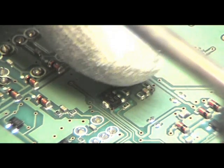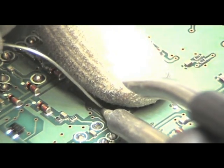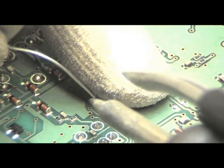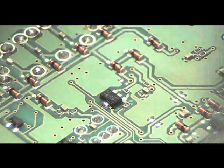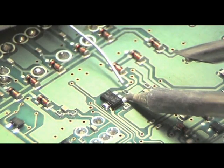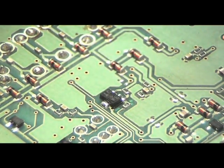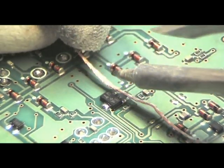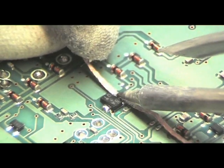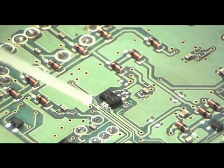I need to put something on the top of it, i.e. my finger, because if you don't it will curl up. That's got it there. Now that's actually got it, which is fine, but what I normally do just to tidy it up a bit is then run a bit of desoldering braid over the top just to mop up any excess solder. Clean any of the excess flux away.